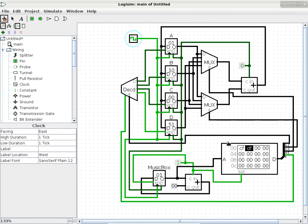Okay, what is comparing? I'll give you two choices. Do you think comparing is adding, or do you think comparing is subtracting? Subtracting. Okay, very good. Because if you subtract them from each other and they equal 0, then they're equal. If they equal 1, then they're not. But there's one thing that we talked about in a subtractor that can already give you some information after a comparison. The borrow flag. Okay, very good.